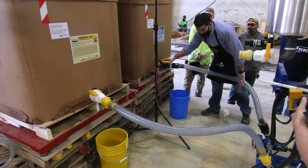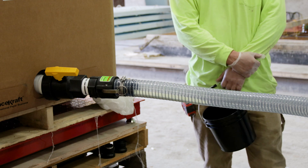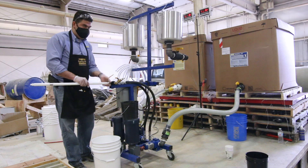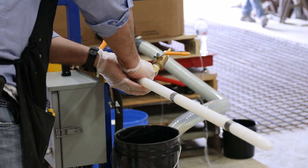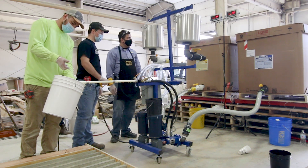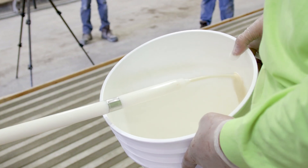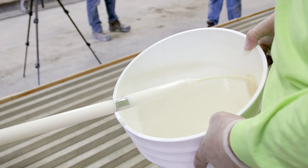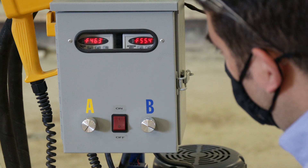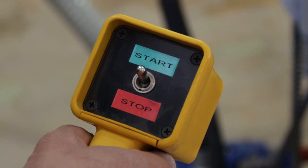The valves are opened and material is allowed to flow to the pumps. A 30-inch static mixer is hooked up to the manifold on the front of the machine. This static mixer blends the A and B components together perfectly while dispensing. A small amount of liquid rubber is dispensed directly from the static mixer into a 5-gallon bucket to help with calibration of the machine. This is done to ensure proper mix ratio prior to starting the large pour. VitaFlex 60 has a 1A to 1B by weight mix ratio, and the machine is calibrated to ensure each pump is flowing at that rate.